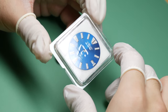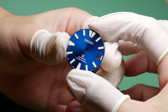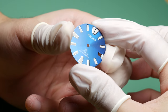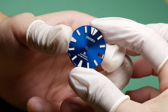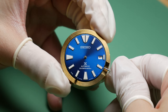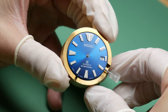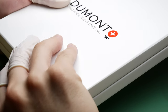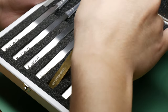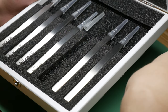For the dial, I'm using the Blue Lagoon Seiko dial. This is a limited edition dial, an OEM part — not an aftermarket one. It is quite rare to find, so I only have a few of these. The blue is lighter than the typical blue found on Seiko dials, and I wanted this color and sunburst effect since it matches well with the other parts I have planned for this build. I prepared this dial beforehand and basically converted it from a strictly 3 o'clock dial to now a 3 or 4 o'clock dial. This involves removing the dial feet and making sure that the underside of the dial is completely flat — if it isn't flat, you'll have difficulty installing the dial because it will be lopsided.